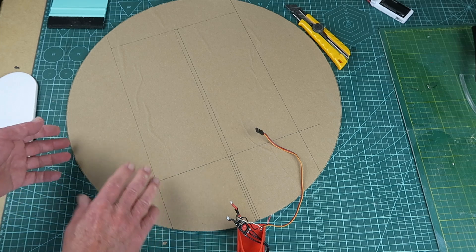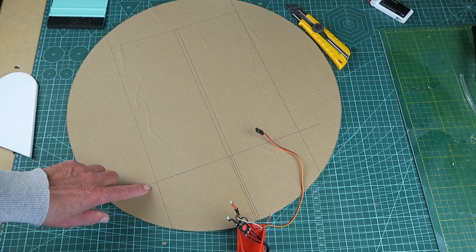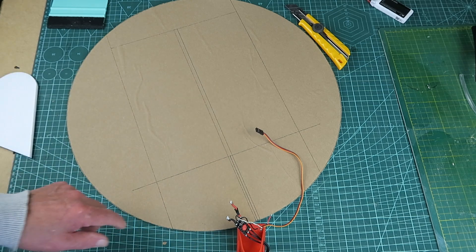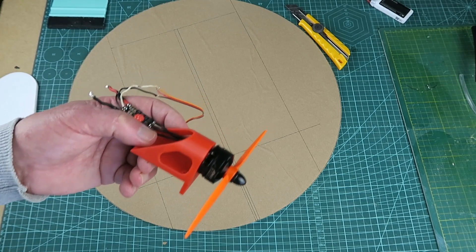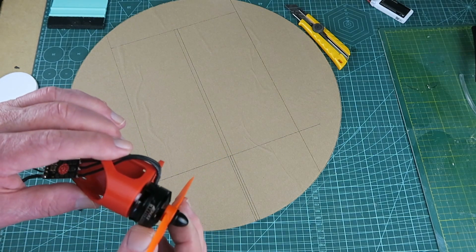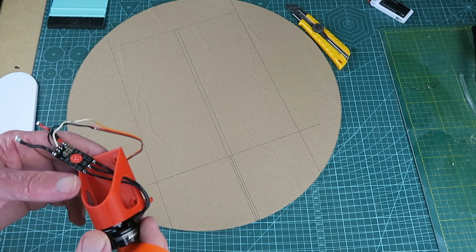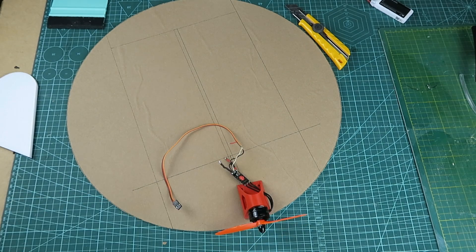This line will be cut and then the wingtips will be raised up. The line here indicates the starting point for the C of G, and underneath there will be a reinforcing rib. This rather neat motor mount I've taken from Thingiverse — links to everything in the description — and that fits this 2204-2300kV motor. Not sure whether it will be running 2S or 3S. The objective is to keep it simple for a change.